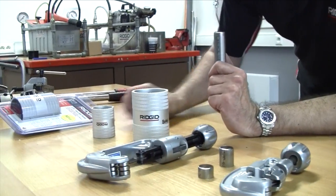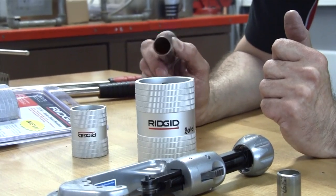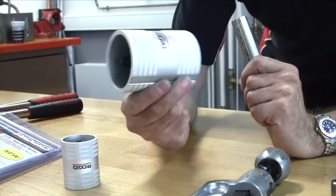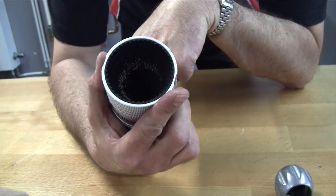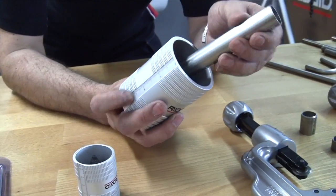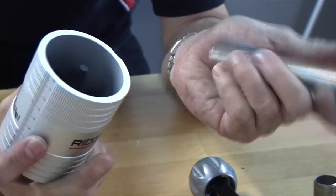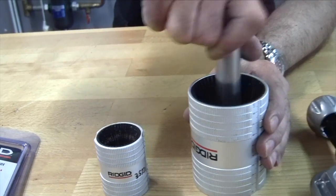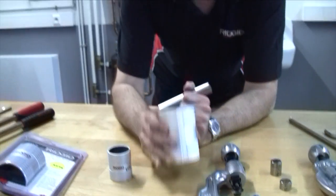And that's what these things do. These are stainless steel reamers from ourselves. We've got two models here: the 233 and the 227S — a little one and a big one — up to 36mm and basically up to 54mm. These are dual function reamers, so you've got a cone on either side. The cone on this side is for doing the internal burr — you simply turn those round and you nick the burr out. If you've got a little burr on the outside edge, you use the internal cones here, put the tube in, rotate it and take the burrs off. And that's how you prep the tube after you've cut it — you need to ream it with a stainless steel reamer.